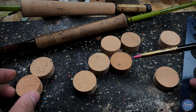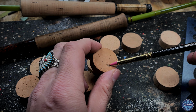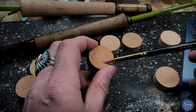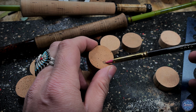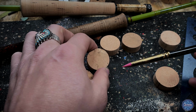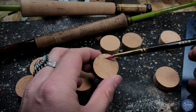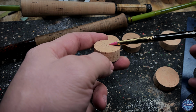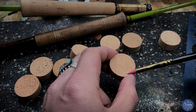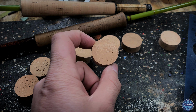So that is my first check down. Like this ring, where it's at right here with that spot, I may or may not turn this ring down, or I may put it on the front end. And if it doesn't work, I can chop that ring out. This ring has a lot of staining going through it as well. You can see it running through, but it's fairly clean. I would probably take a shot with that. This ring, there's no open pits to it. Either side, there's no discoloration, so that's a pretty good ring.